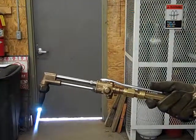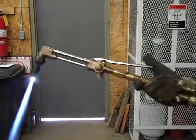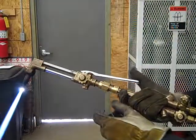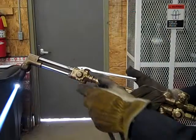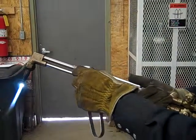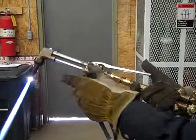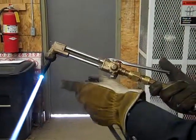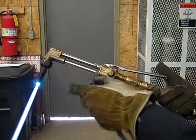When we first adjust it, I always like to come back and hit the button and readjust — and that's what I'll do now. Remember to always look for the inner flames — dark, dark blue, very sharp and defined.